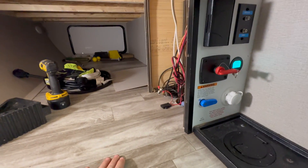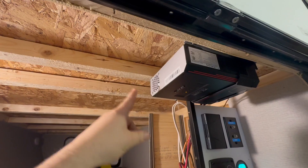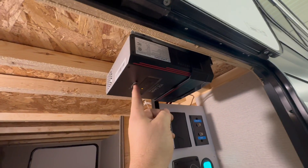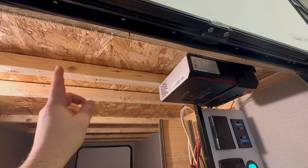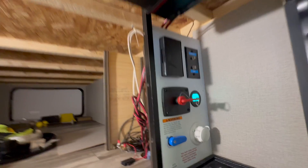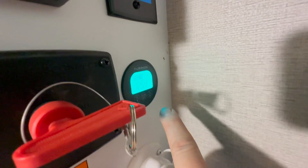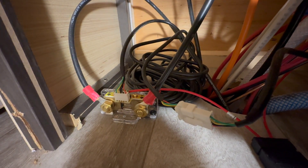Let's get some light on this situation. What I'm going to do is put a board up here, cover it in carpet, make it look nice, and attach the new charger and a breaker box to protect everything. We're leaving this Furion charger in here because we've got panels up on top — we're going to leave those. We're actually just adding ground deploy panels, essentially creating a separate system and running them in parallel. Here's how we'll connect it into the rest of the system. We've got the shunt right here — it's not terribly accurate, but it's better than nothing. So we will leverage that.